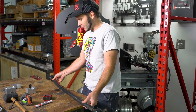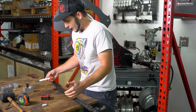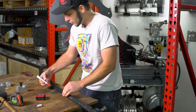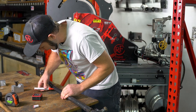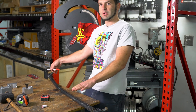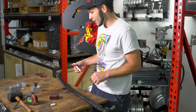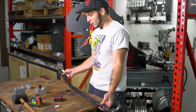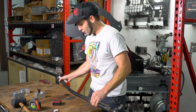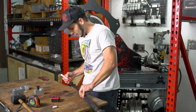I'm gonna set it on a relatively flat surface — it's farm equipment, we don't have to do this perfectly — and I'm just gonna mark basically what part's gonna be up in the machine. We're gonna be bending this way, so I'm eyeballing a mid-plane; if you want it perfect, half the material's thickness with a straight edge would be a perfect way to do that. I'm also gonna visually mark where the center of this bend is.